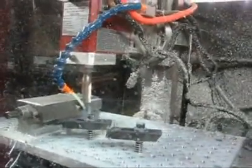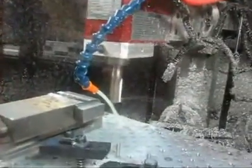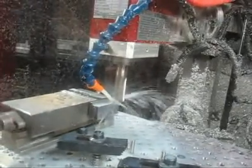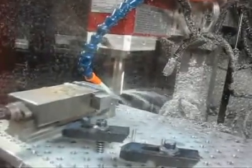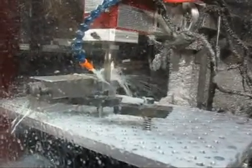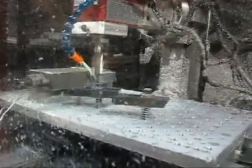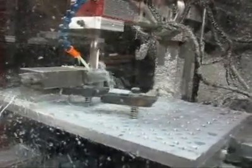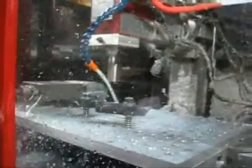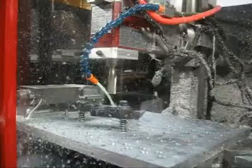It's taking off about a half inch width of material. Mild steel. More to go. Now I can keep recutting the finished pass, taking 15 thou off. Clean it up.